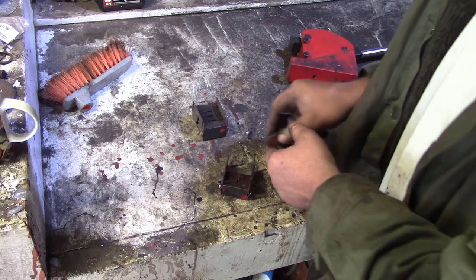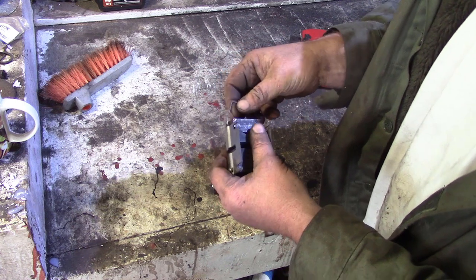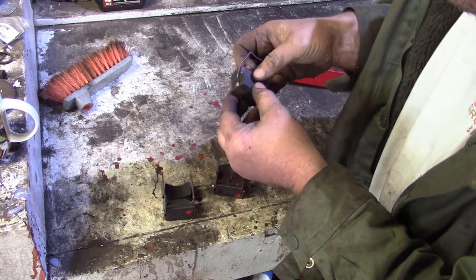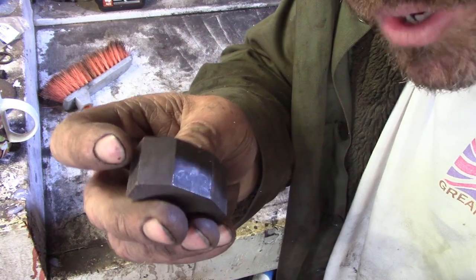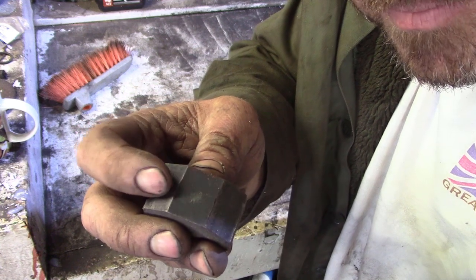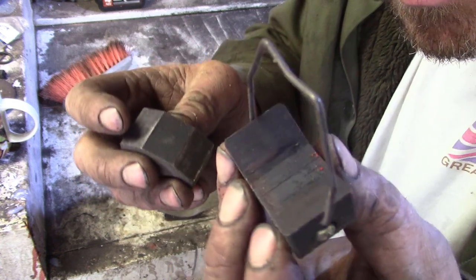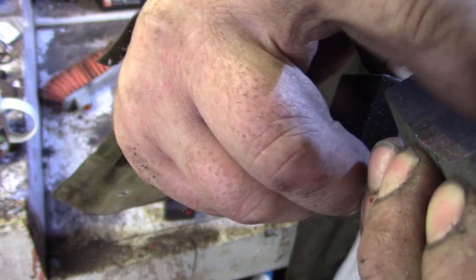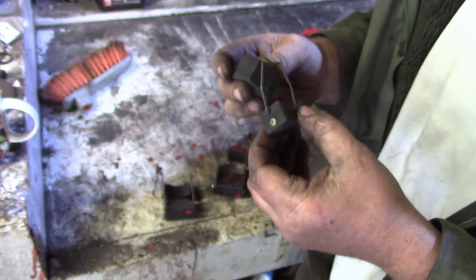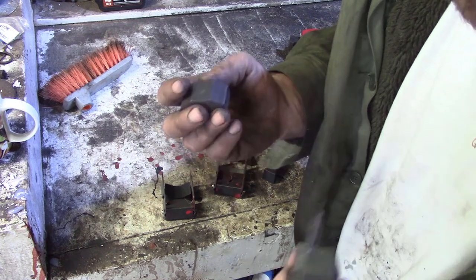These ones have cleaned up, shiny surface there, and the reason none of this was working when I got it was because this is obviously quite a cheap one, and you got these tool marks, the cutter marks on the block and anvils. Can you hear that? Can you guess what it is yet? Sorry, Ralph. So all I did on the shrinker jaws was polish these surfaces up, and it works perfectly.